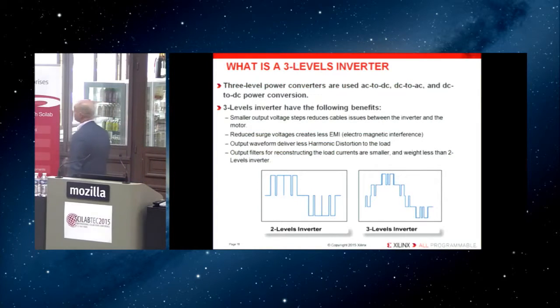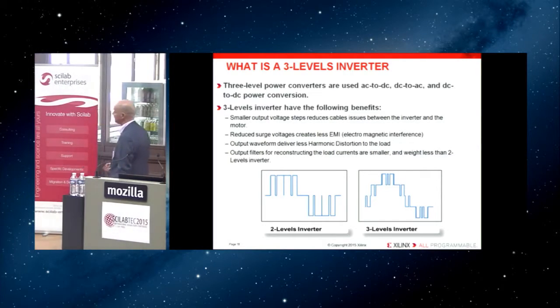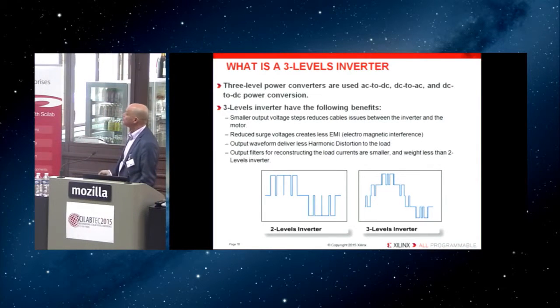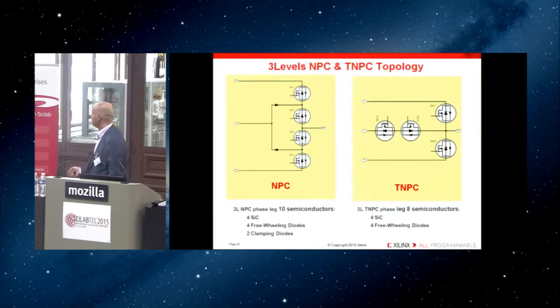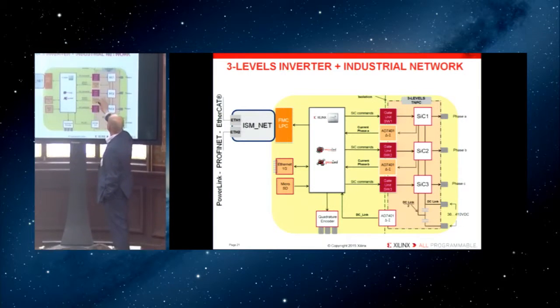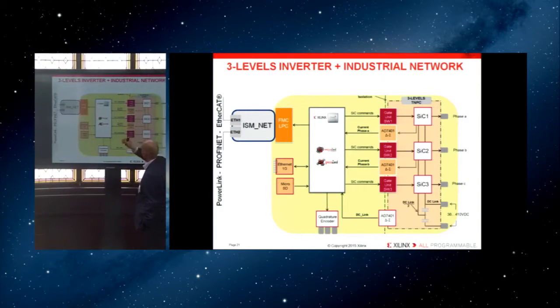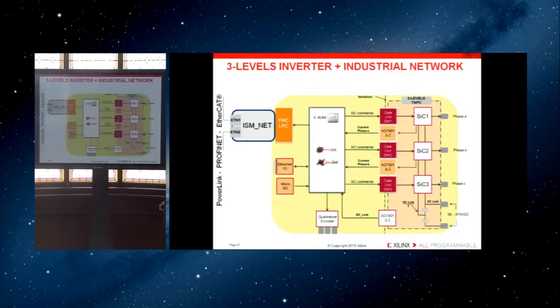For additional parts, you can move to even more complex systems like a three-level inverter, capable of delivering extremely high power to motors. It can be used for, for example, an electric car or aircraft where weight constraints are very stringent. This configuration is used in another board — a very high-power system — used in conditions involving high speed, dust, and vibration.